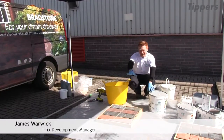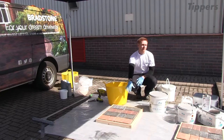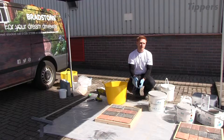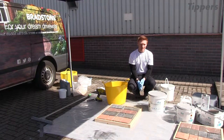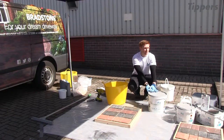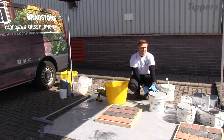A good look at Speedy Paving Grout — we're going to be doing a demo here. This product is typically used on block paving like we've got here, or on larger slabs. Because of the area we've got and we're really looking at the product and the joints, we're doing it with block paving. This product will do between 5 and 50mm joints, and the joints we've got here are about 10 to 15mm.